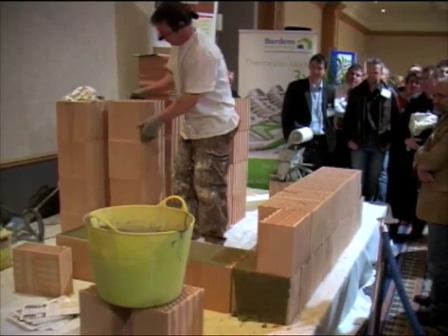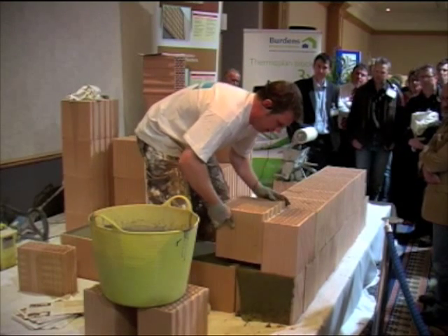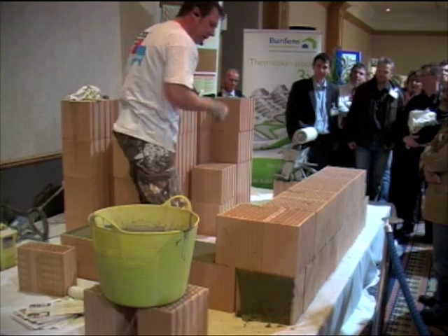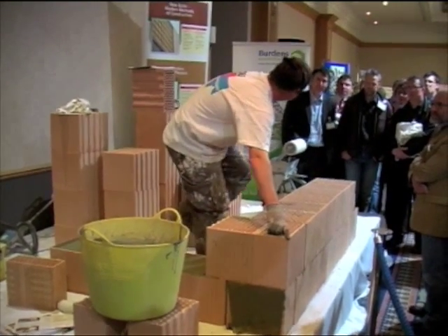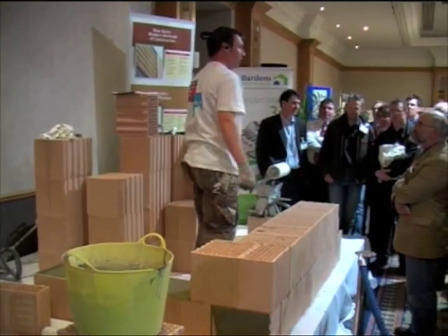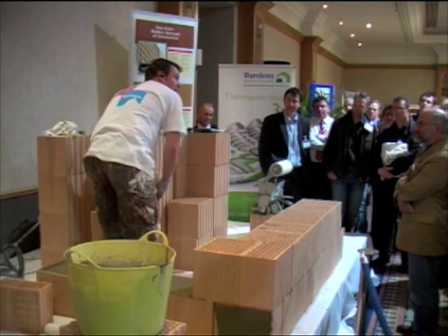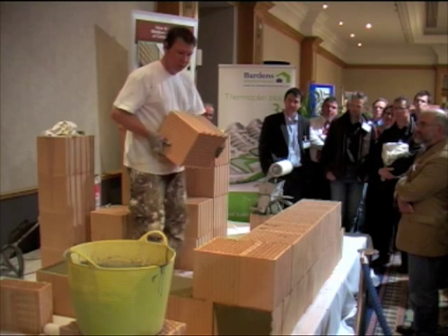And that's all we do — it's set up ready to take a block. If you get a bricklayer unit, you'll tend to want to put a line across it, put some profiles up, and run a line along the front. Because it's not a facing material, it does need a face on it, so it's entirely up to you what you go with. You can have a rendered external, you can have a clad system, a brick clad system — anything along that sort of line.